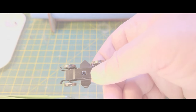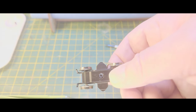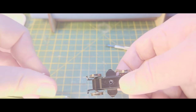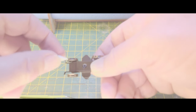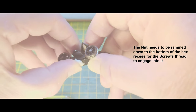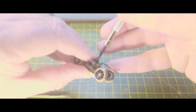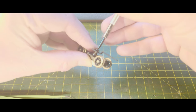Trick of the trade I found: if you just put your thumb over there and try to screw it, it won't reach — the screw isn't long enough. So what you've got to do: get a bit of tissue paper — kitchen towel — cut off the corner, roll it into a little ball, only small. Lick it or something, you want it squidgy. Put it in there, in the clamp — it pushes it to the bottom of the recess. And carefully turn it over, don't let go of it, and then somehow get the screw in the slot and do it up.